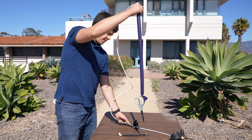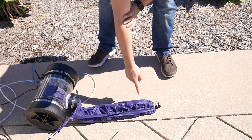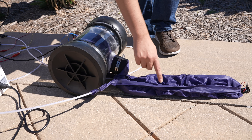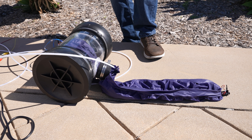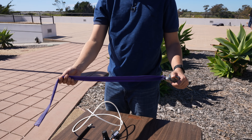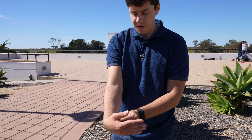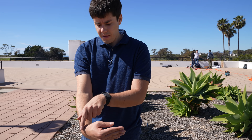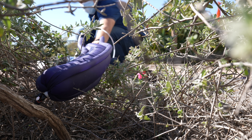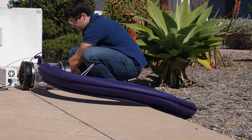What they use instead are simply tubes of ripstop nylon fabric with the braid oriented at 45 degrees — just one single layer of airtight fabric. The main robot body has three pneumatic muscles connected to it, each connected to their own air supply and regulators. As the robot extends from the tip, they can steer it by shortening and lengthening the sides — just the way your hand works if you shorten a tendon. As the muscles inflate, they'll turn it one way; inflate the one on the other side and it turns the other way.